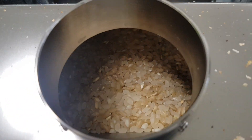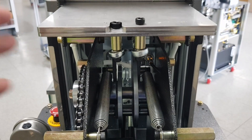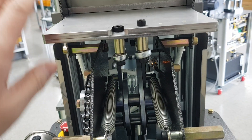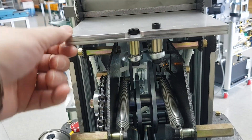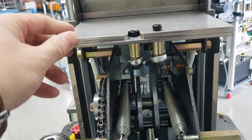It processes rice mix and brown rice. This is the feeding plate — when the feeding plate is fully backed, the sensor shows a red light. When it moves forward, the light turns off; when it moves backward to the end, it turns on. That's very important — if it's not turned on, the machine cannot go to the next stage.